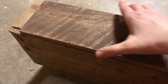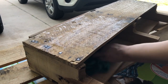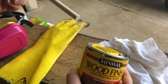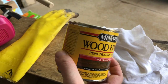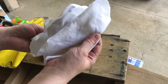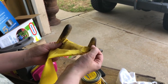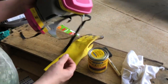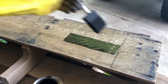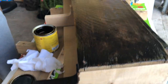Once the screws and everything were assembled, it was time to finish the project. I tapped heavily on the wood while wearing a dust mask to remove sawdust, then wiped everything with a damp washcloth and let it dry. We decided to stain the wood with a water-based dark walnut and used a cheap foam brush to apply it. I like to cut up old t-shirts to use as rags to wipe away drips or lighten the stain if it's too dark. I suggest having doors open or working in your garage on a nice day and wearing a protective mask to avoid inhaling fumes. I started coating the entire shelf — it only needed one layer as it was darker than expected, but it still turned out really pretty.